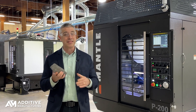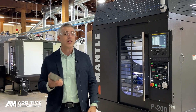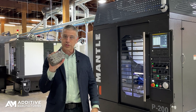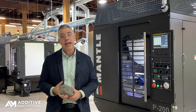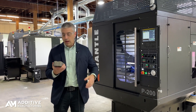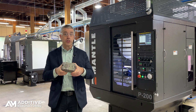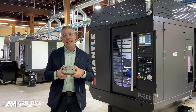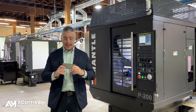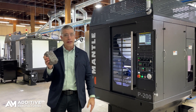The TrueShape system consists of the machine that deposits and shapes the metal paste, software that controls precision through sintering, and a sintering furnace tuned to this process. A mold tool like this, produced through 3D printing and the TrueShape process, can be printed overnight in its green state, and the sintering step takes somewhere around 30 to 40 hours.